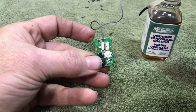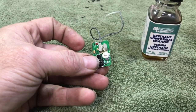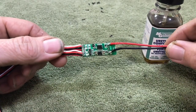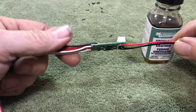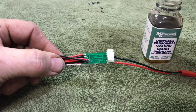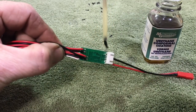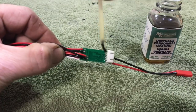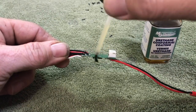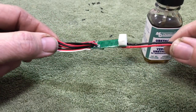I'm going to go on top of the white stuff here just to make sure I've got a good coating everywhere. Now it gets to sit for a while. I've done this one since it was so simple — there's no switches, no contacts — just got to coat everything. I'm going to go ahead and catch the back side, which is pretty much nothing there, just to be thorough. If this thing goes underwater these terminals are going to make contact regardless, but anyway, this one can now sit and dry, then it'll get some heat shrink and be ready to go into the TRX4.